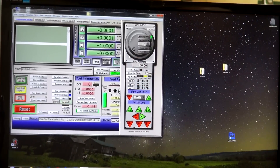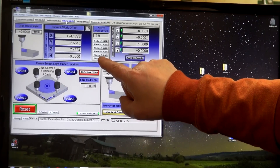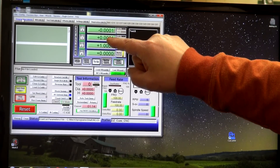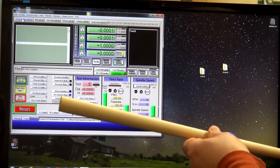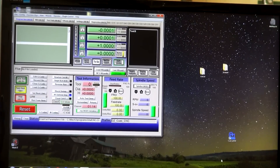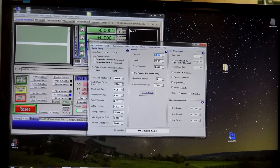My spinning station is G58 — that's our active work offset. When I'm at that location, X0 and Y0, my cutter is set up on the center line of my spinner at the back shoulder of my shaft. It will be along that center line and that back shoulder — that's XY0. It's always going to be XY0, and that's one of the nice things about this program. I can rely on that. I'll start Kelly's program and go to shafts.